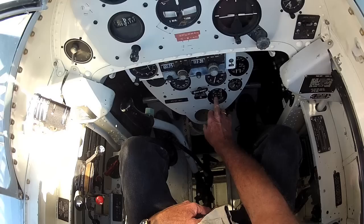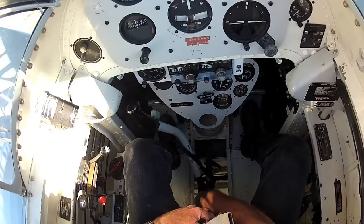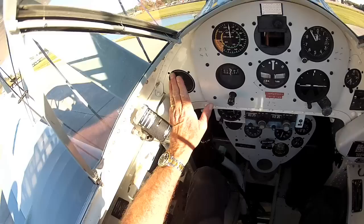And if for some reason this quit, then I'd know exactly how much I've got there, because this aux gauge in this particular airplane is more accurate than this main gauge. And of course, you've got the same range for 65 gallons over here as you do for 125 gallons. So if this is a little bit off, it's going to mean there's more fuel within the same amount of arc there. Mag switch is here.